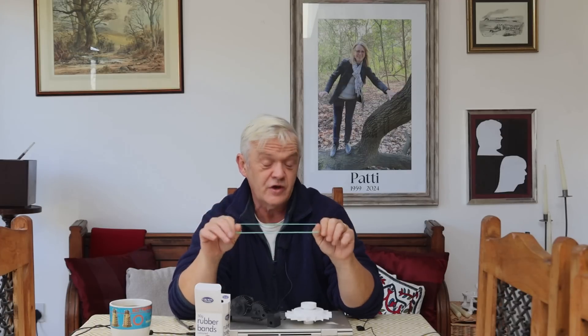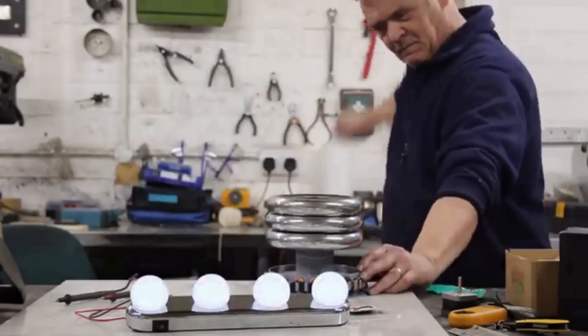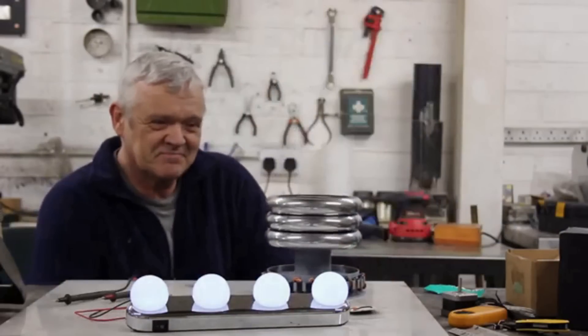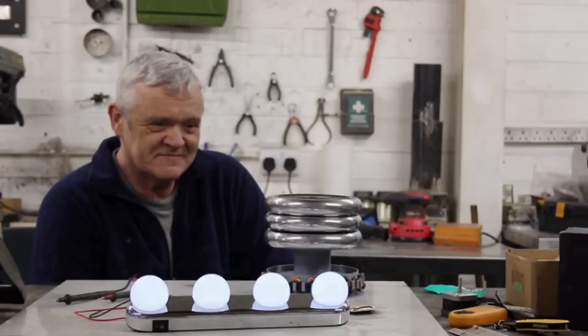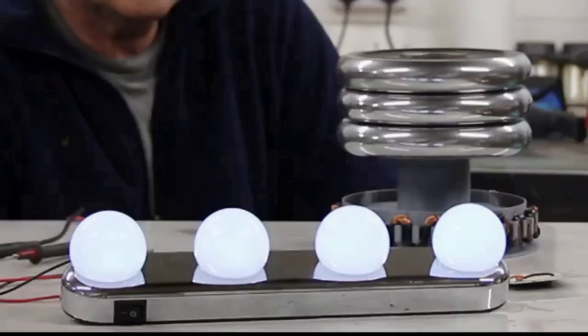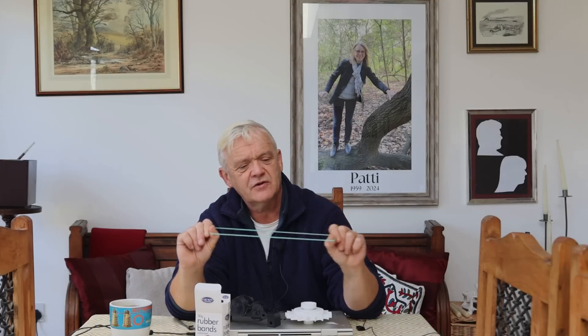And of course there is — we can work with this one-shot deal. One way to do it is to put it into some kind of battery. If we connect this to a flywheel — the flywheel is a mechanical battery — we take the one-shot, spin it quickly, attach that to a flywheel, the flywheel will spin up, and then spin down slowly, giving out the energy slowly that we just put in quickly. We did that with things like pull cord flywheels. Another way is to directly convert it to electrical energy, like when we made a generator, and store that in a battery or a super capacitor, and release it nice and slowly that way.